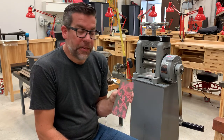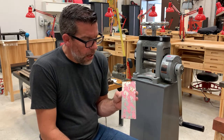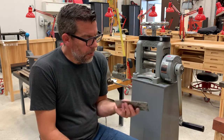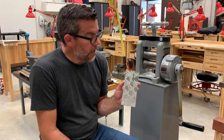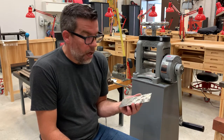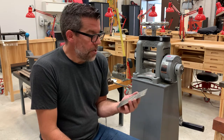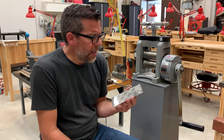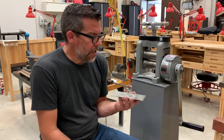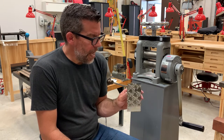This had a vinyl resist. I was doing a double-sided plate but didn't etch this deep on this side. I wanted to show you that on the front side this stainless steel plate has been etched. You could etch steel with the same aluminum etching solution I've mentioned earlier. In this case I think I did salt water, and the salt water etched the stainless steel — I can't remember exactly, I just happened to have this pattern plate.